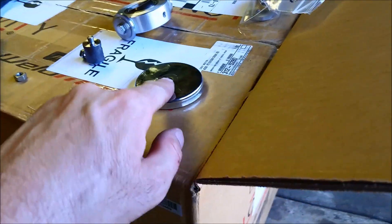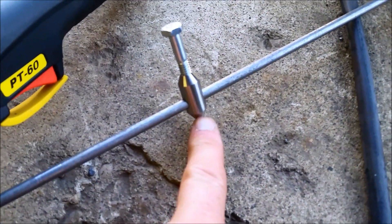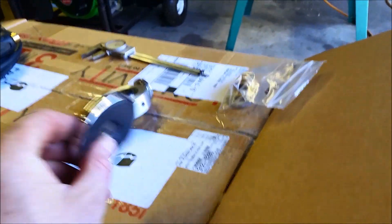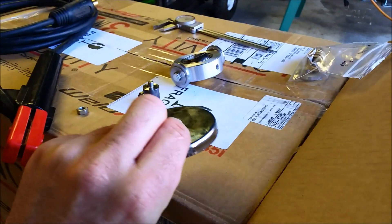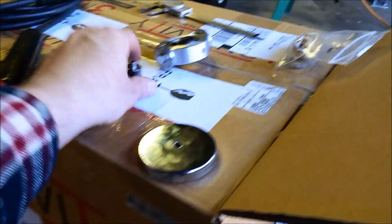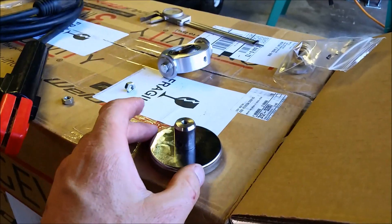I think the other thing I'm going to do is build a little quarter-inch piece similar to this, with just a little center punch on it so you can slide it through the magnet and locate it on the center of a hole. Then you set the magnet down right on center, it'll stick, and then you can pull that out, put the other piece back in, and go about your business plasma cutting.